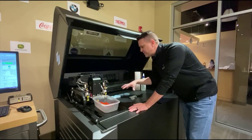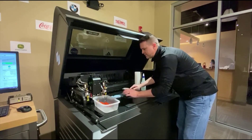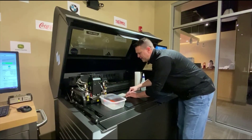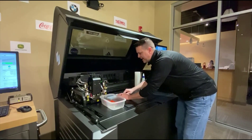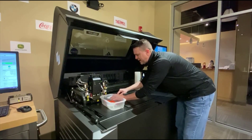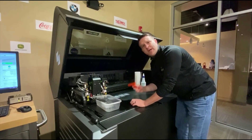Take some time to gently get these off and clean this area appropriately. I first use a larger scraper just to remove the parts — and again I'm trying to be slow about it. I don't want to just start shoving support material all over the build area, or particularly at the print block. By removing parts with the big spatula first, I can be very careful and precise to get those pieces off gently, and then come back with some kind of a razor blade.